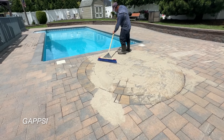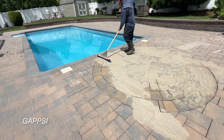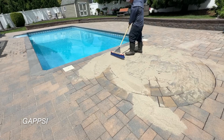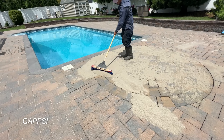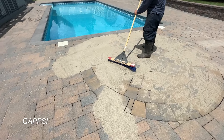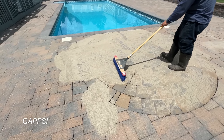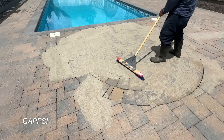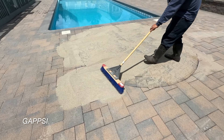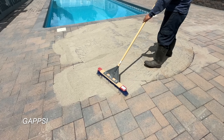We're filling in the joints. We're using just colored sand — the sand will absorb the sealer and become polymeric sand. We're using a beige-gray color sand that almost goes with the many different colors of stones, from brown and beige to grays.